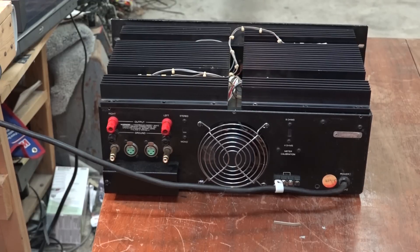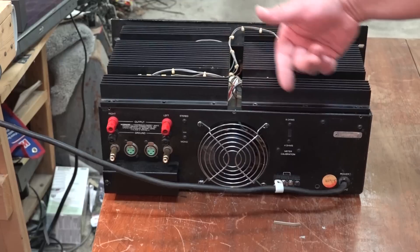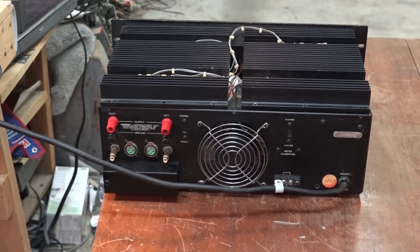That's how you modify one of these big amps — put in a nice quiet 12-volt fan. I'm running it on 5 volts because I don't need full airflow in this application. It just keeps it nice and quiet and we don't have to worry about this thing overheating, with air flowing over the components all the time. I can put the screws back in, put the cover on, and this one is taken care of. I hope you enjoyed this video — we'll catch you in the next one.